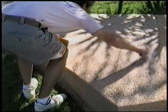The best trowel to use for doing plaster repair, Kool Deck repair, any of that, is this type of rounded edge trowel that we're showing here. It doesn't dig in when you're troweling as much as the square type trowels, the rectangle size.